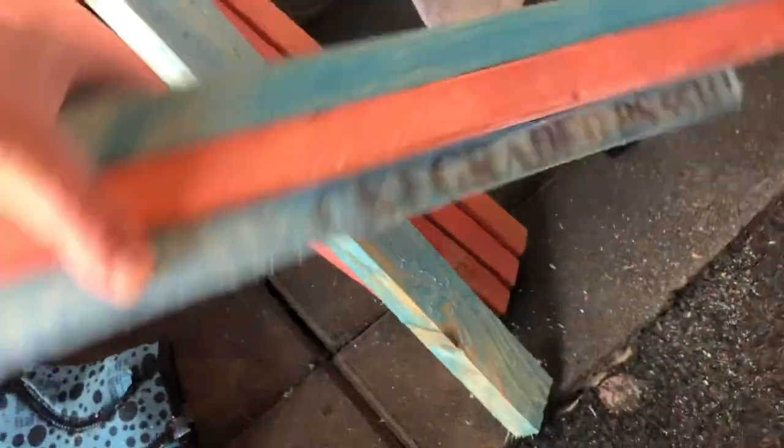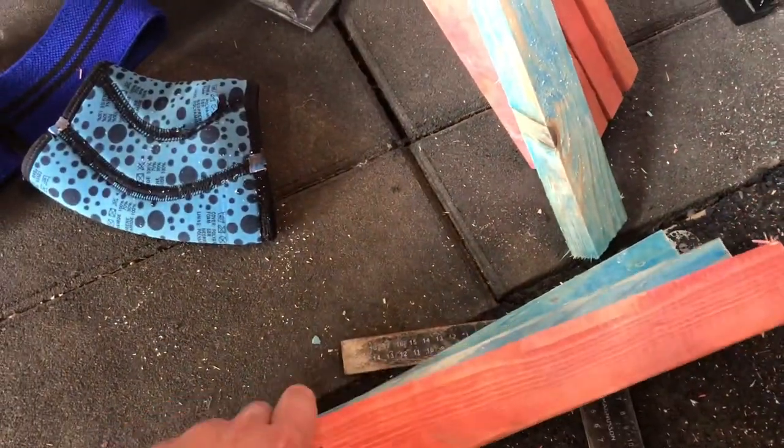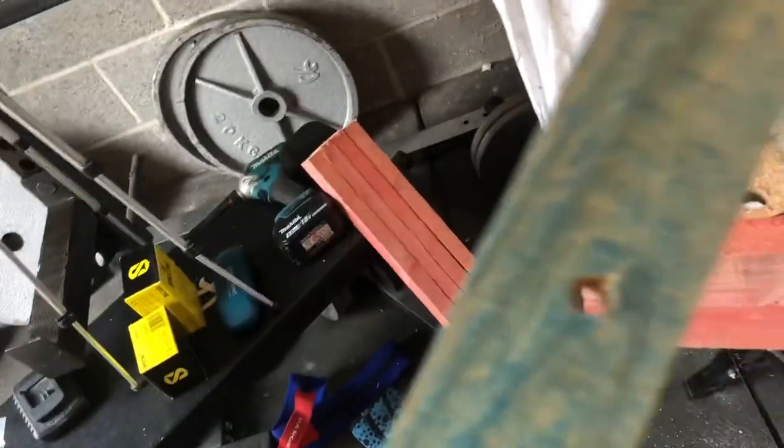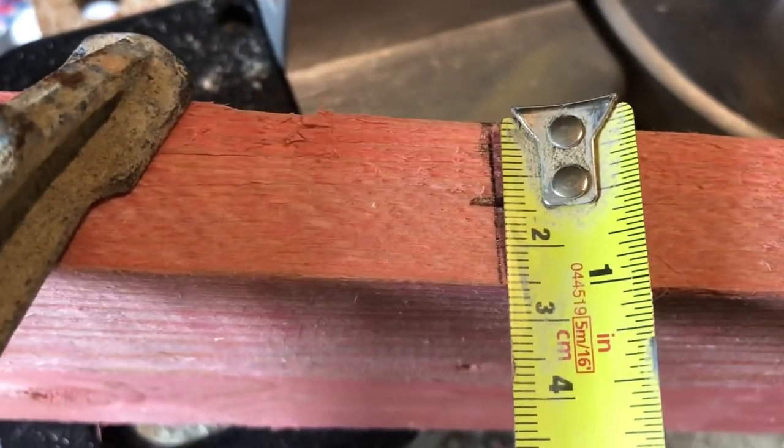There's four 460mm internal pieces - just imagine those attached in theory. In the last clip I messed up - I drilled the wrong side of the wood, I should have drilled the thin side of the bottom but I drilled the flat side. These pieces are going to be used for the supporting pieces. This blue stuff's quite wet anyway so I'm going to try and use most of this red stuff. We've got a couple of pieces squared up at 460mm, marked in the centre at 230mm - and then it's 25mm thick so 12.5mm centre.